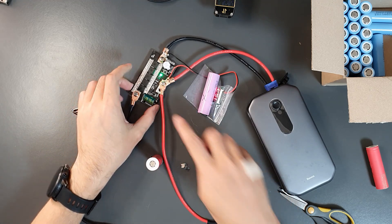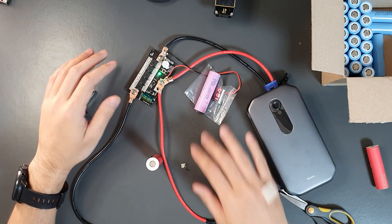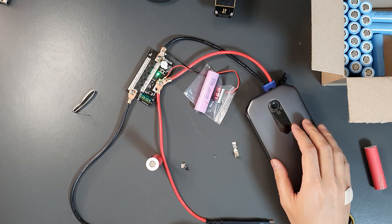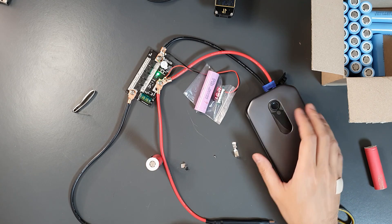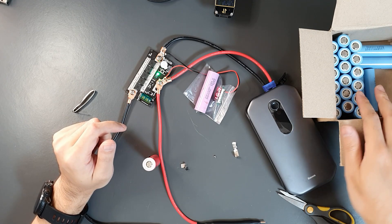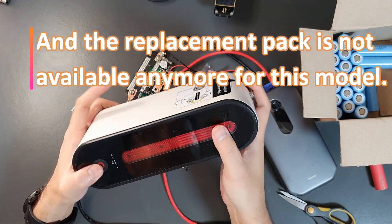The welder is working great. This kit is around $10 and the voltmeter is $2. If you already have a car jump starter like this one, you can easily set up a portable spot welder. You can use a 3S or 4S lithium-ion pack, a 4S lithium iron phosphate pack, or even a 12-volt lead acid battery. The reason I need this spot welder is to rebuild my e-bike battery — I have LG 3200mAh cells here.